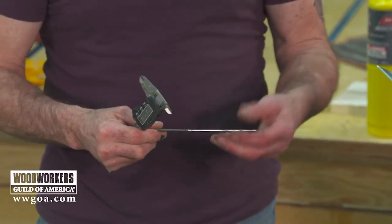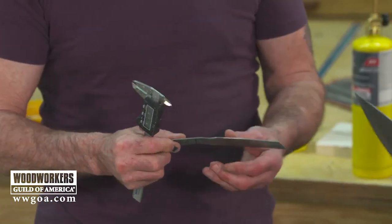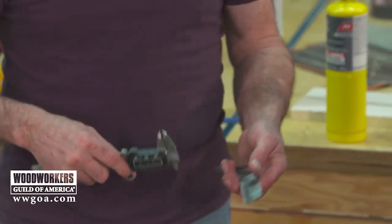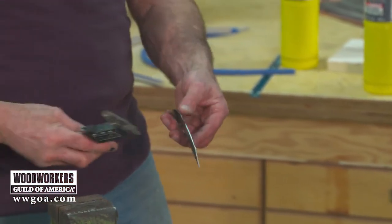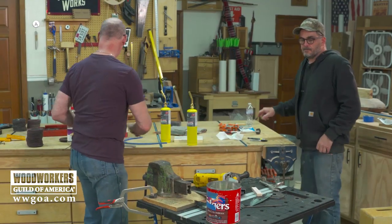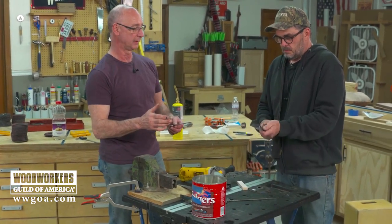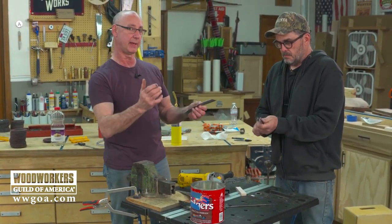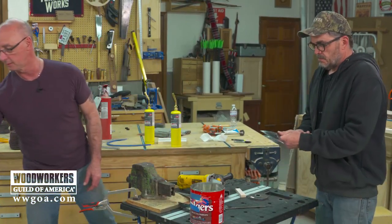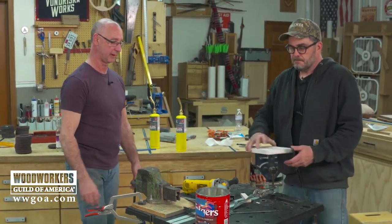It's a little thin. And, like in my world of making knives, it's a little flimsy. It's a little thinner than most knives. This wouldn't be a take it in the woods and work with it kind of a knife. Yeah. But like Jimmy said earlier, it's an experience of shaping a blade, working with a blade, putting a handle on a blade, which we're also going to do. There's a lot of cool stuff going on here. So I think, again, if we were in a plate where it wasn't carbide tipped, where the whole blade was the blade, you'd have a thicker plate to work with. You'd have a thicker knife when you're done. More robust. Don't make a machete out of a table saw blade. It's going to be too thin.